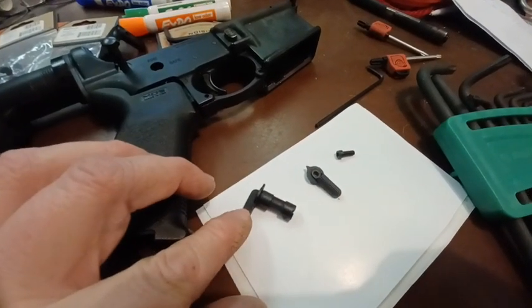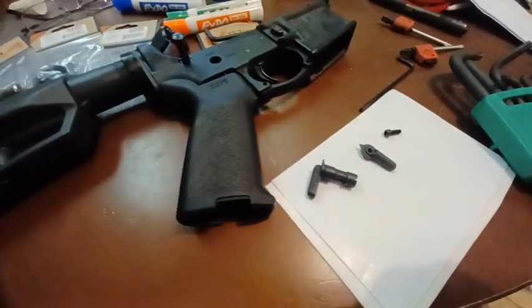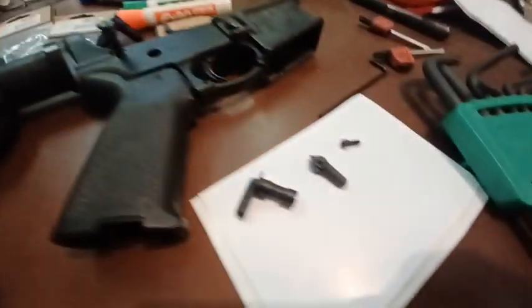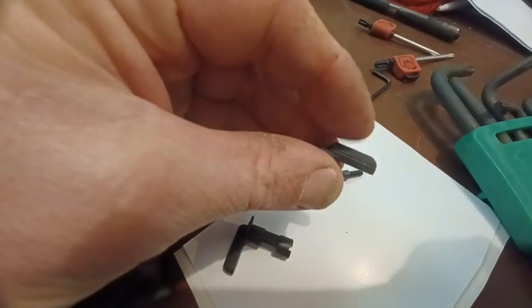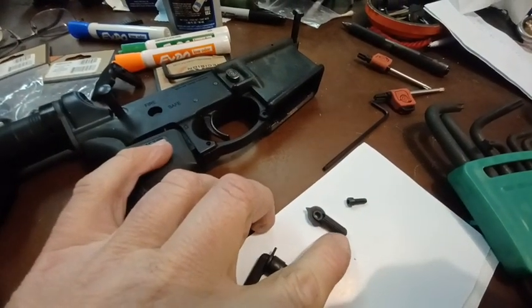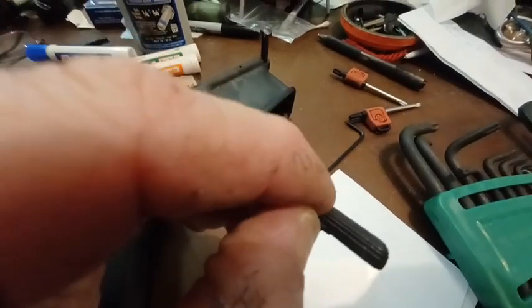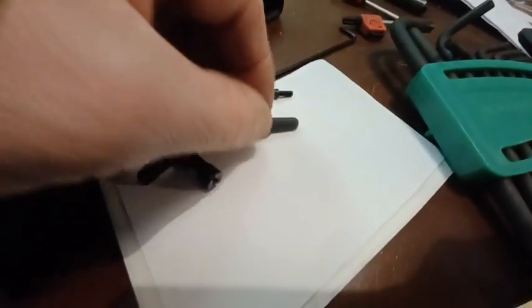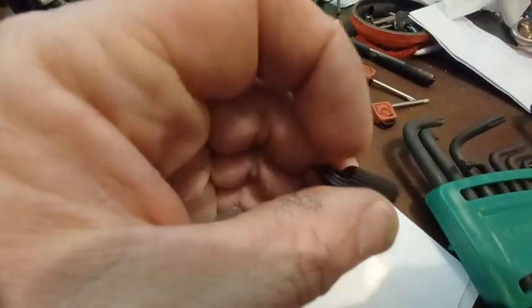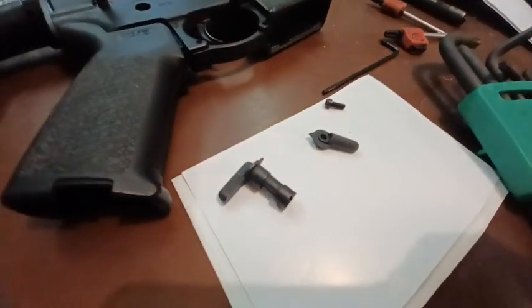They do make ambidextrous safeties that are long on one side and short on the other, but they're usually a lot more expensive — sometimes $75 to $100. I got this for $25, so I'm not going to pay that. Since I got four of these, if I decide I need it shorter on my trigger finger side, I'll just take a dremel — actually I used an angle grinder because the material's quite thick — and grind it down, then use the dremel to fine-tune it. It's cool how they have lines there, so you dremel down to that last level and leave it. You just dremel half of it, leave half the meat on there, then take a Sharpie and paint it black if you need it.